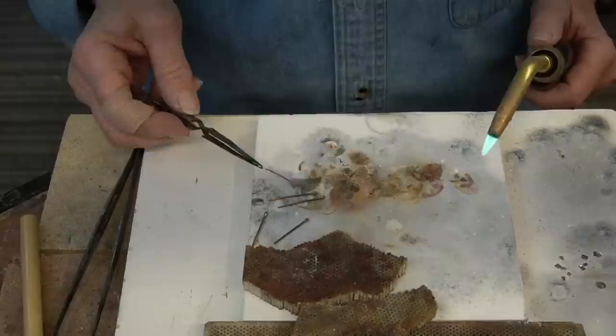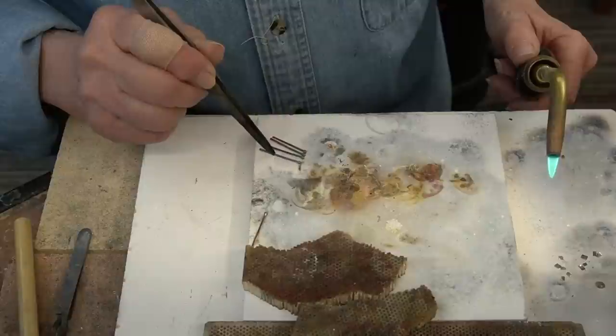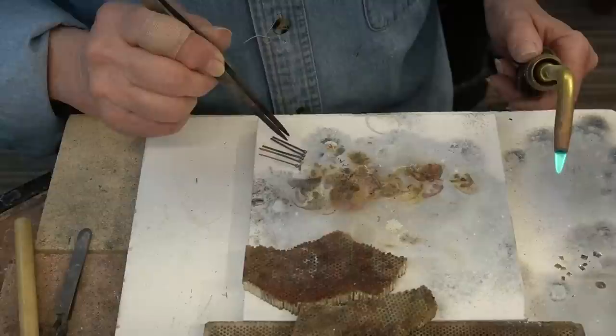Important thing to say about when you're balling back the ends of wire, no matter what wire you're talking about, is you have to think of gravity. So if you hold this straight up and down like that, the ball's going to be on the end. If I held it out sideways, the ball would be like a drop off the end going down. You follow me?